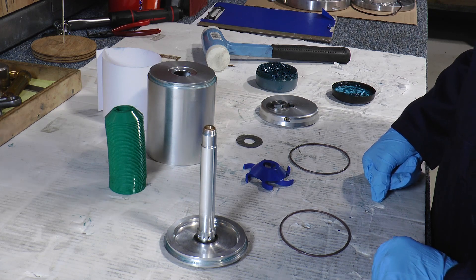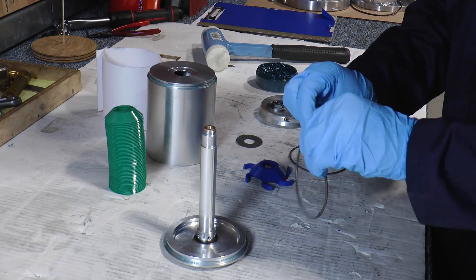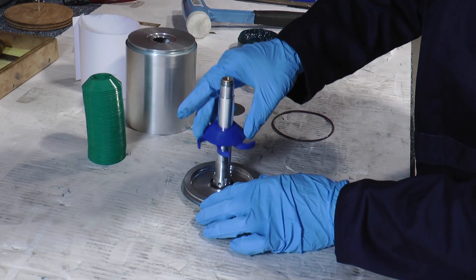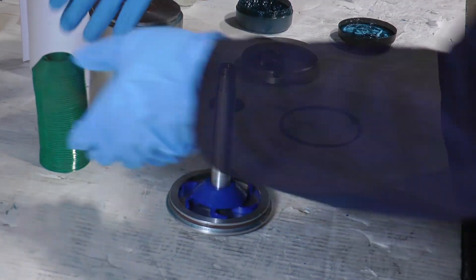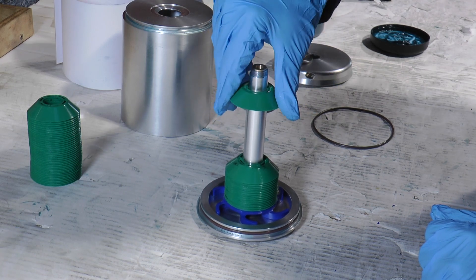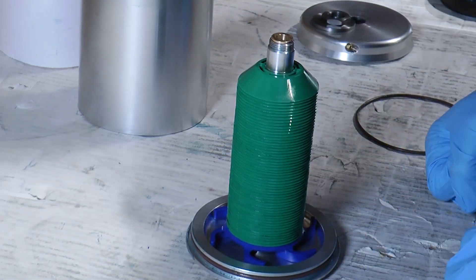We're now reassembling the clean bowl assembly. First thing to do, if we've taken any of the O-rings out or we're replacing them with new, we use a little bit of silicone grease and insert into the groove in the distributor plate. We now take the distributor impeller, place over the bearing tube and just find the location slots so it sits down. We replace the bowl discs if we removed them — we can do these a few at a time. Gently press down and twist until you find the notches. The disc stack is now back on the bearing tube.